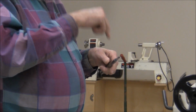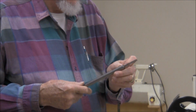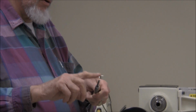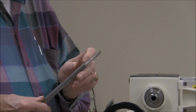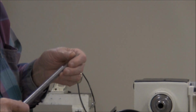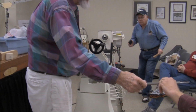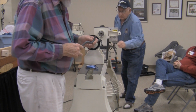Rather than drilling and tapping, basically you bore a hole in a piece of 1018, the size of the diagonal of the tool bit you're using, and if it doesn't quite fit, you just kiss the corners on your grinder and then epoxy it in place, or super glue. Who's doing that? Dave Ellsworth and Trent Bosch, both just glue it in. Now that one fits pretty tight. I don't know if that one's just tight or it's stuck in there.